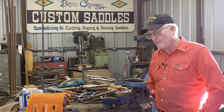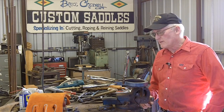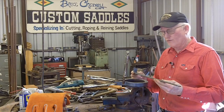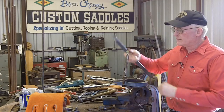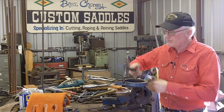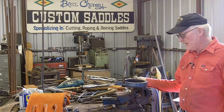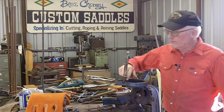I'm building a pair of five and a half inch inside diameter Oxbows. I bent this first one — the stock is cut 20 inches long overall. I put a 70-degree bend on it to start on one side, clamp it at the top with a pair of vise grips, and then use my large heating tip to apply heat and slowly walk the strap around the fixture.